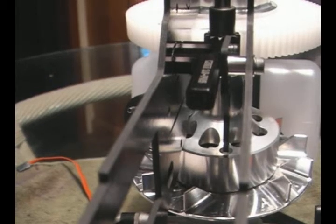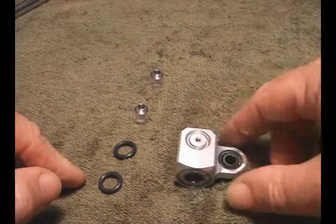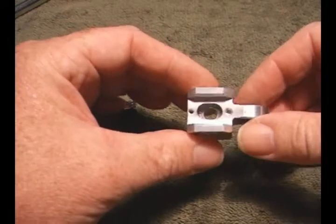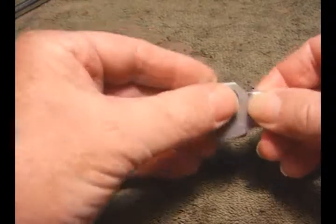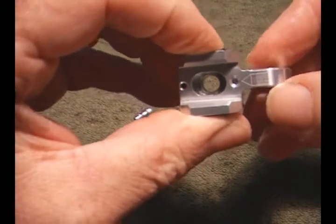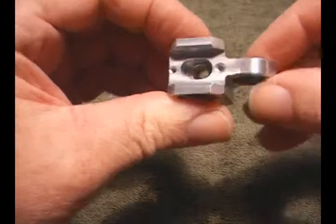I'm not going to use this because I'm using the R7100R with the sensor already mounted on the crankcase back shaft. First off, from bag 1, the 2 bearings, spacer and O-ring are already pre-mounted into the assembly, but we might have to service that in the future. The damper block is rather interesting. It's got recesses for the O-rings, which we can easily place in there now. For the bearings, it's actually got a lubrication slot on there. You see it says oil with a diagram with a hole down there and an arrow pointing to that.